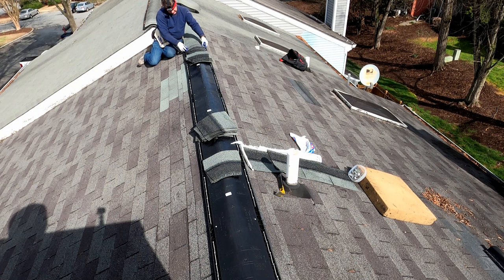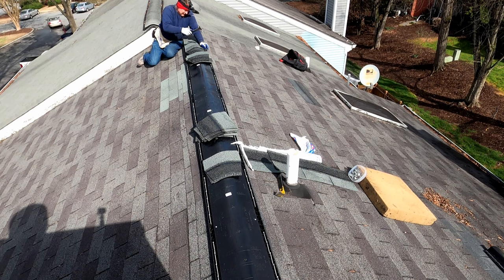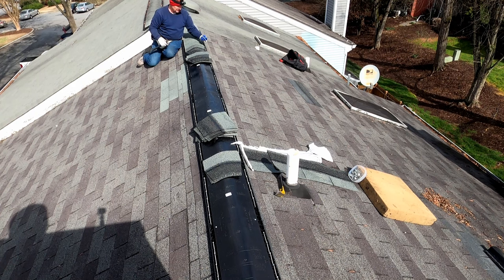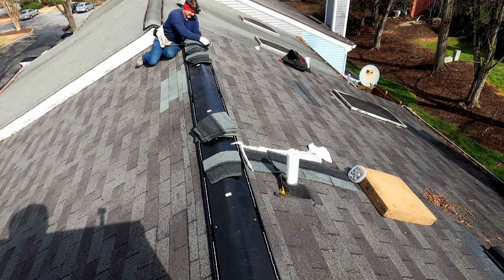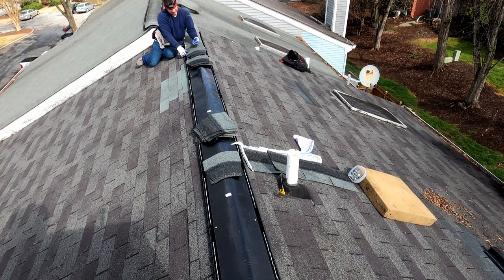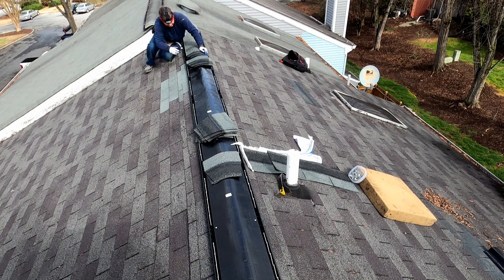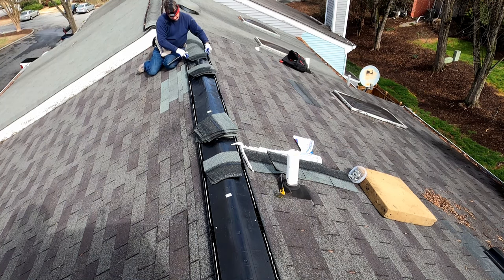The reason a lot of these nails are being very reluctant to get started is this building is built on trusses, which means that there's only a rafter every 24 inches instead of every 16 inches. And that makes everything a lot bouncier, especially up here at the top end of the decking. So getting the nail to start penetrating the decking can be a little bit of a challenge. As you near each rafter, it gets much simpler when you're out there between the two rafters. Definitely a big bounce factor going on.